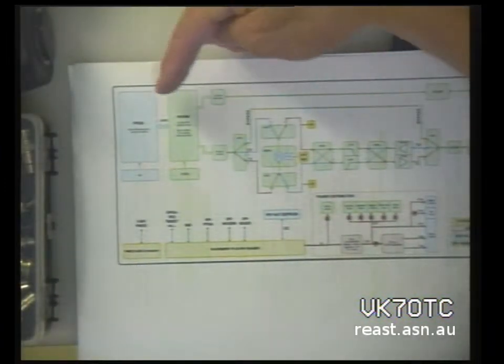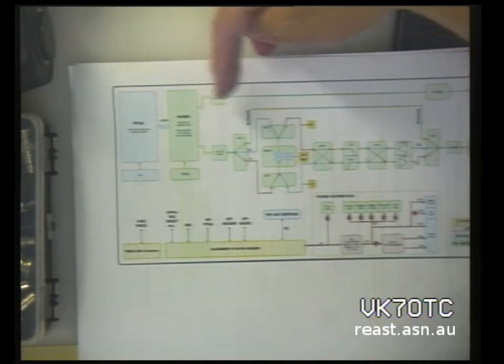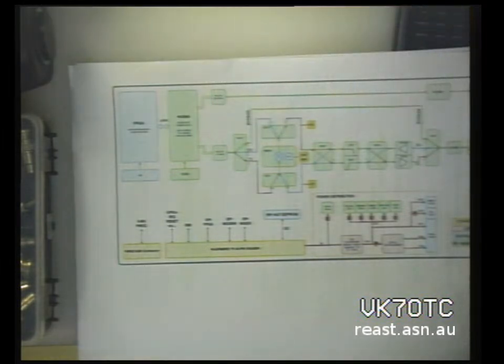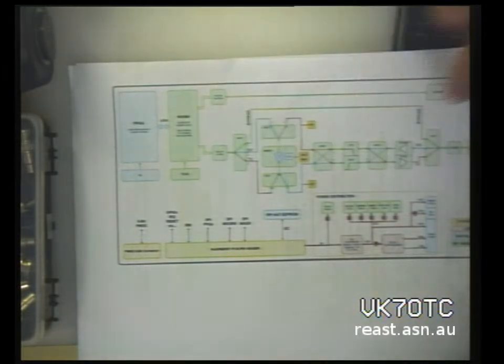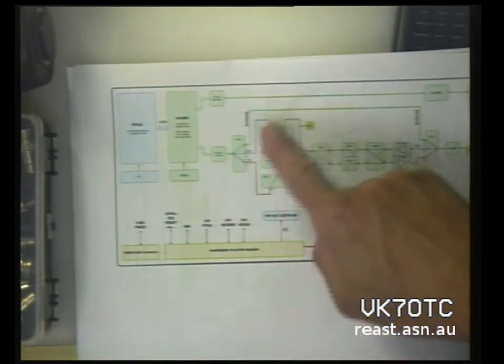You can see the FPGA, the mixer chip, the actual modem chip. Then you've got the sub 1 gig, which is basically straight through with a little bit of, I think that's a filter, balun, so that's matching, out the low-pass filter and then out. And then the 6 gig chain, there's a little bit of an RX-TX switch. There is a mixer in here.